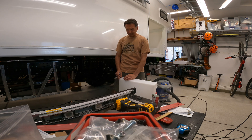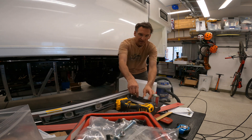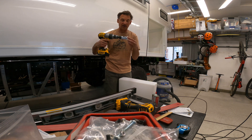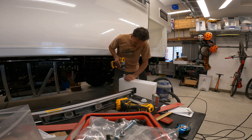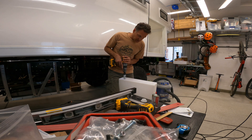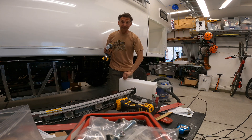I'm going to put the fitting roughly not quite in the corner, because I've got some metal frame going in this corner. I'm going to put it as close as I can to this edge and circle the inside — that is where my spin weld fitting is going to go. I take my drill bit with the appropriate size. Let me double-check these spin weld fittings are the same — they are. I hold the tank tight between my legs; it's not ideal but there's a fitting on the other side making it a little wobbly. Voilà — there we go.